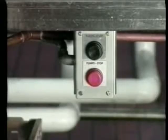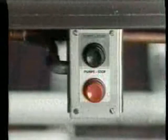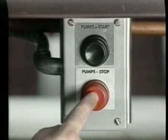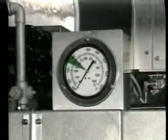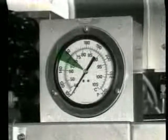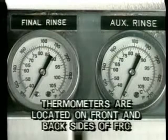There are control switches which start or shut down the drive chain and pumps. They are located on the main control panel and here at the load section of the machine. These controls consist of a water-resistant start and stop button. The black button starts the machine and the red button stops the machine. There are ten thermometers on the Fast Rack ware washer which monitor the water temperature in the various sections of the machine. There are two thermometers per section located on the front and back sides of the machine.